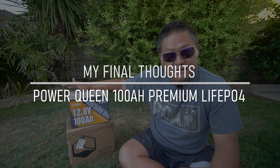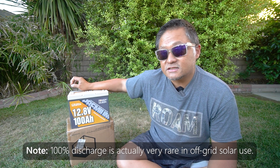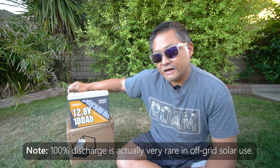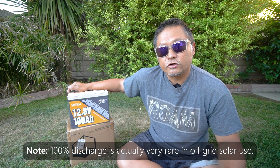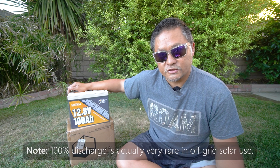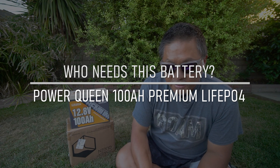As you can tell, this passed the capacity test. There is something different about this battery compared to the other ones I've tested in the larger form factor — because it's a different BMS, it has different settings programmed from the factory, so it appears to cut off at a slightly lower voltage, which is why the BMS goes into fault mode on a deep discharge. Who is this battery for? This battery is for people who want to build beyond just a 12 volt system. Other cheaper options let you connect in parallel for 12 volts, but this one lets you connect in series up to a 48 volt system — and that's because of the new BMS. The second type of person it's for is somebody with limited space: 25% smaller in dimensions is a pretty big deal. And lastly, somebody who needs a battery now and doesn't want to wait 30, 60, or 90 days for it to ship overseas.